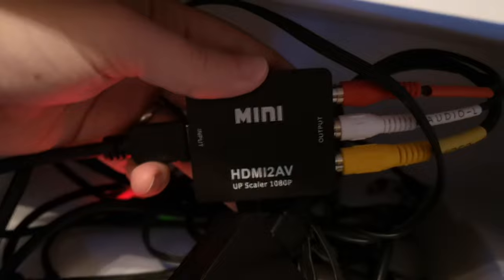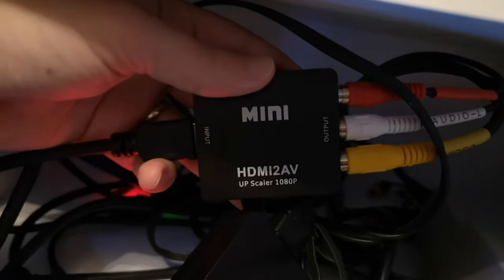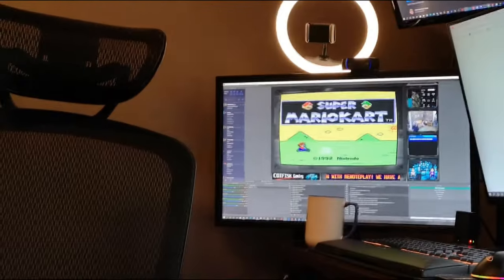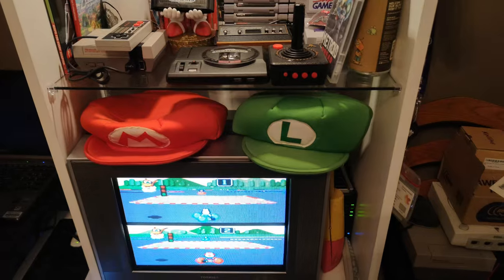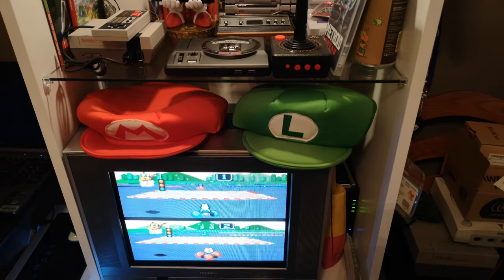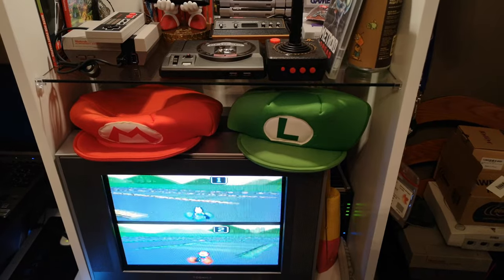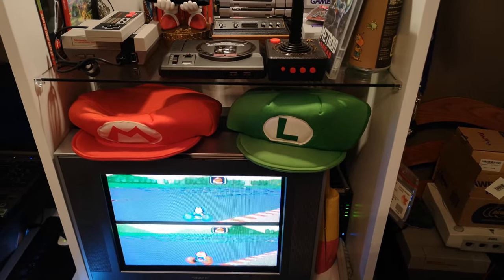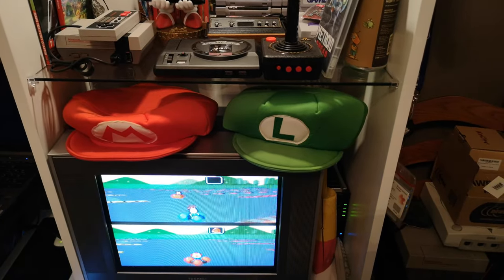The HDMI splitter goes back into analog video, and the analog video goes into the back of our CRT TV. That allows us to have CRT downscaled video simultaneous with our OBS stream. So if I turn on my TV right now, I should see Super Mario Kart — which I do. It's important to note that I have an HDMI capture card, a USB 3.0 Blackmagic Intensity Shuttle, that has an HDMI pass-through allowing me to also see it on my monitor.